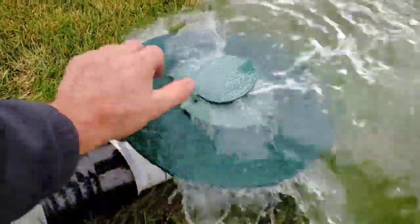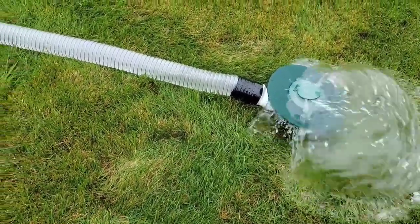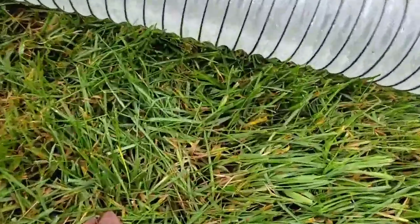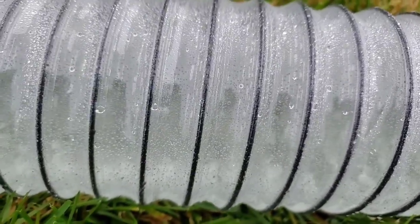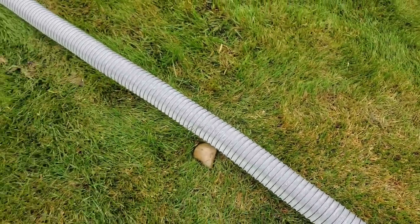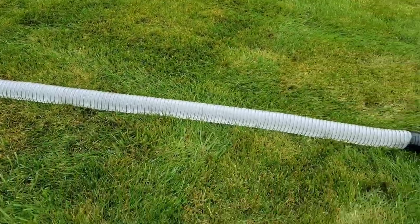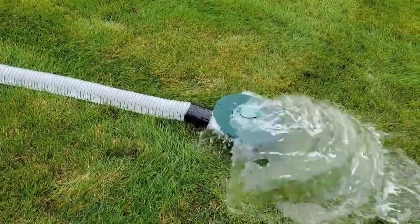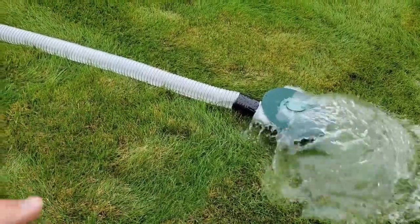This is a three-inch pop-up. I chose a three-inch pop-up because it holds less water in the elbow. It is on a clear translucent four-inch corrugated pipe so you can see the water inside. The water comes down the corrugated pipe and finds its way to the pop-up emitter, which has a three-inch elbow. This technique will also work for a four-inch pop-up. If you have trees with big leaves, stick with a four-inch elbow. If leaves aren't a concern, a three-inch elbow holds less water and will perk that little bit of water much quicker and easier.